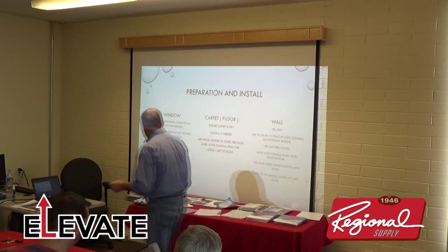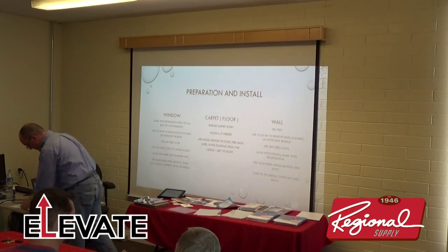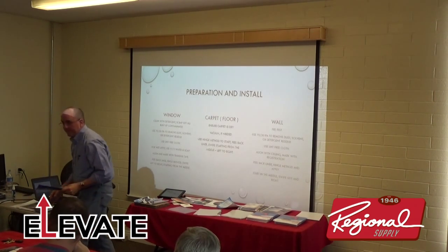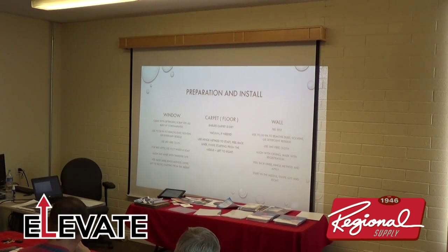I was just looking at the floor graphics media table here. This product, Street Wrap, says it's for unsealed concrete walls and floors, unsealed asphalt floors. So if I was putting something on the floor in an auto shop, that would probably be a more robust adhesive. As long as it's not coated. If the flooring is coated, and you use that product, it won't come through. You mean like a painted floor surface? Painted floor, it'll pull it through. Or if it's coated with an acrylic or a varnish, it will not be able to permanently stick. If it's not coated, it'll permanently stick. You're okay.